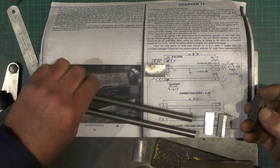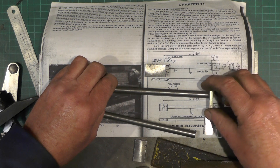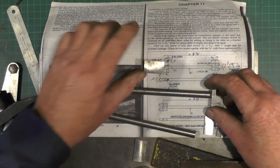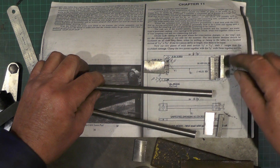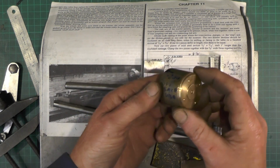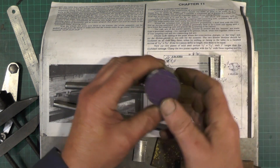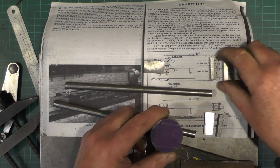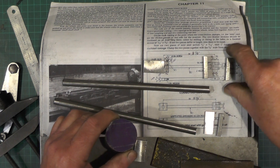Then on this end you've got your bar. This will be fastened into the bar and silver soldered, as will this — but not yet. So there'll be one of them on each end with the bronze in the middle. And I've got this offcut of bronze here that I'm going to machine up to the relevant sizes, cut it in two to make two sides, and then cut it in two again to make two halves of the actual bearing.